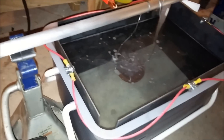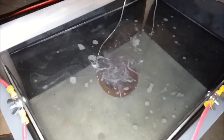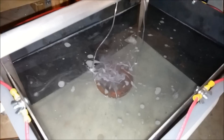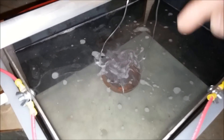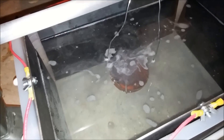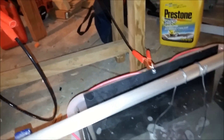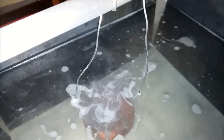The other thing is I'm using 12 volts right now. There are several ways to change the amount of current it's using. The most common way is probably to just change the amount of washing soda you put in here — you can regulate the reaction that way, up to some saturation point. The other way is to change the proximity of the piece you're cleaning with the plates — if you move it closer to one of the plates, you should see a stronger reaction. Probably the easiest way is to just use a different voltage. I'm glad I saved these other five- and three-volt leads, because if this is a little bit too aggressive, I can always switch to a lower voltage.